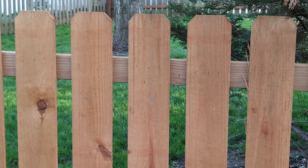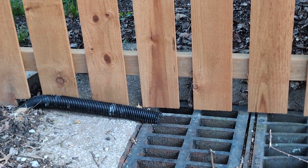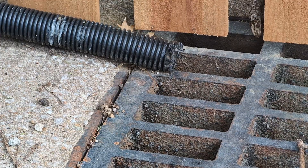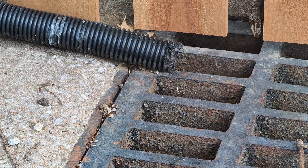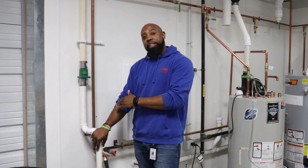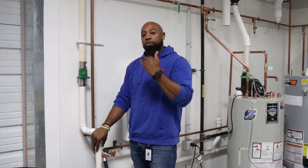I would go outside and see where your sump pump discharges. Does it discharge directly into the yard, or does it discharge underground? If it discharges underground, it is definitely time to call a service professional to try and protect the life of that sump pump and put an air gap outside. In the case of a discharge line freeze in the winter, that water will still have somewhere to go and not shoot back into the basement.